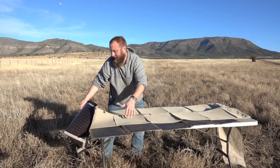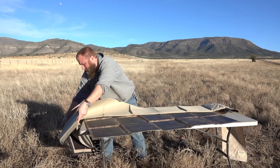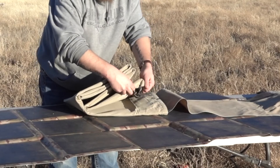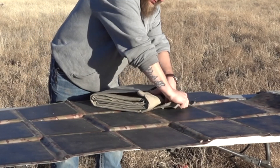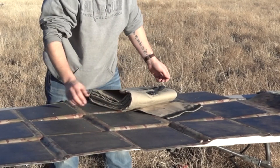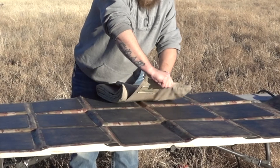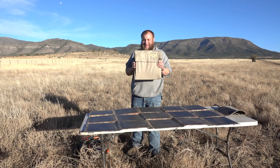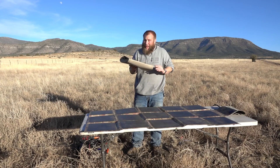When you're closing these up, there's a certain fashion you go about it, and once you know that, they're pretty easy — folding up nice. I really do like how soft the PowerFilm is. It's not really achievable with the Off-Grid Trek because those panels are square and hard and can't be bent or folded in the same way. I also like the flexibility of the PowerFilm if you're trying to fit it into a bug-out bag or something like that. But please know its limitations — I'm only pulling 12.2 volts off of this, and most of the time you want to get your batteries up to 13.5 volts or so. It's not quite doing what I need it to do.